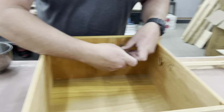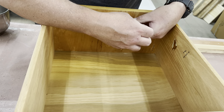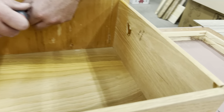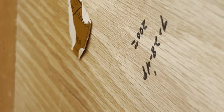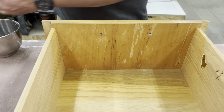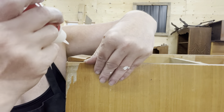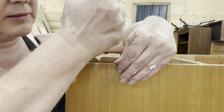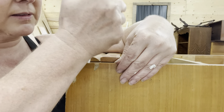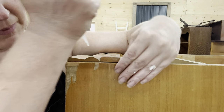So as Chris was removing the hardware, we noticed a Sharpie date on this. We couldn't really tell — I think it cost $200 — but we could not tell exactly what year she had purchased this. And if you notice, there was some veneer missing off the bottom. It's just chipped and gone. So I'm going to take some Starbond CA glue and put some glue to tighten up what is there before using some Bondo to patch this.